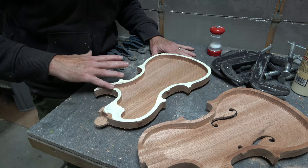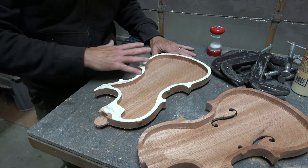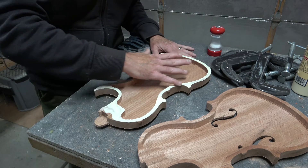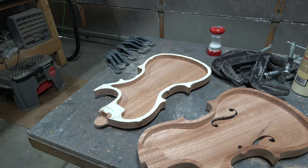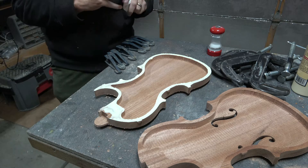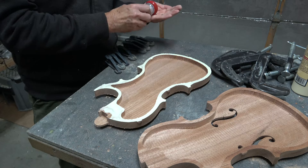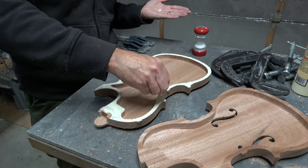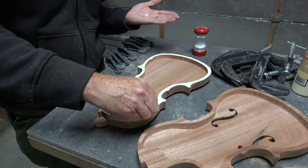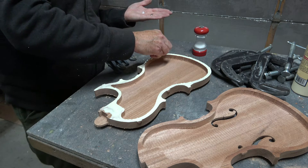I've got plenty of clamps here. I've never glued a small violin body like this together, so I hope my clamping method is going to work. I could use clamps or I could use the inner tube from a bike tire — just wrap it around and pull it tight. Before I put the top on and start clamping, I'm going to use some table salt: I'll sprinkle just a few grains in a few spots, and what that does is act like a gripper to keep the two pieces from sliding against each other, because wood glue can be pretty slippery.